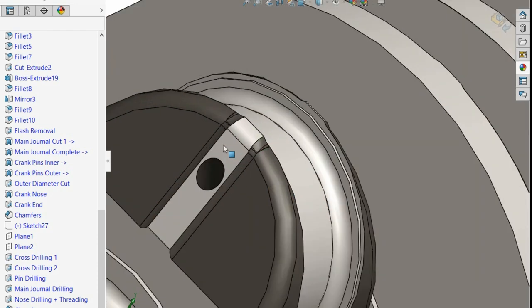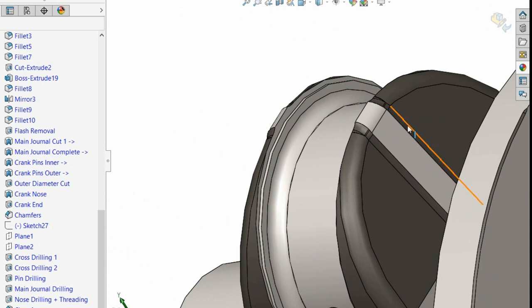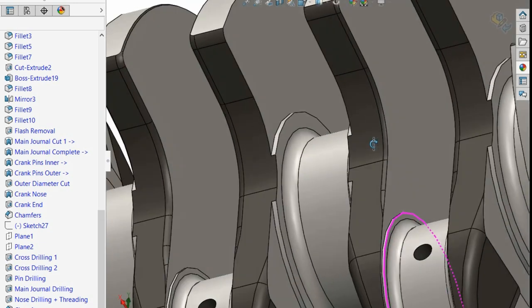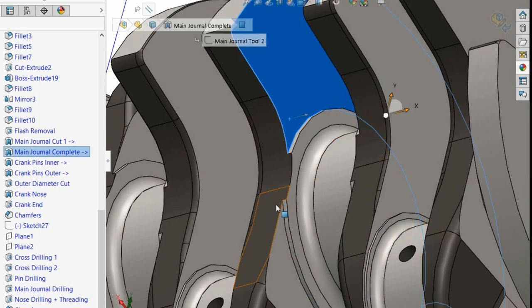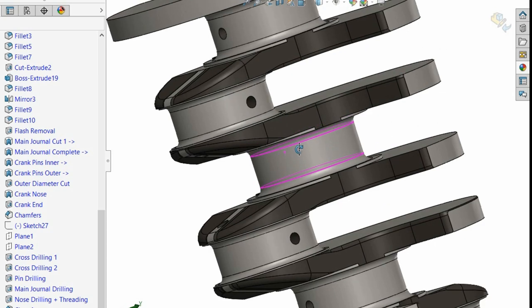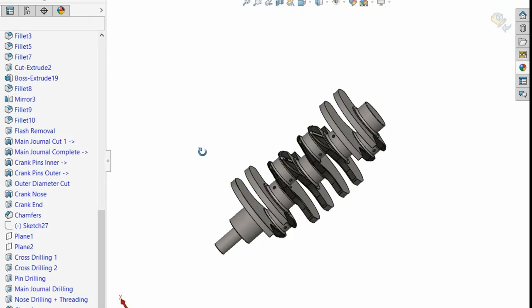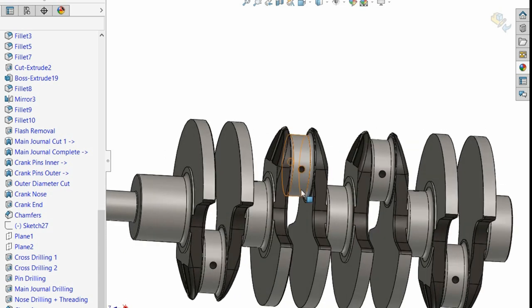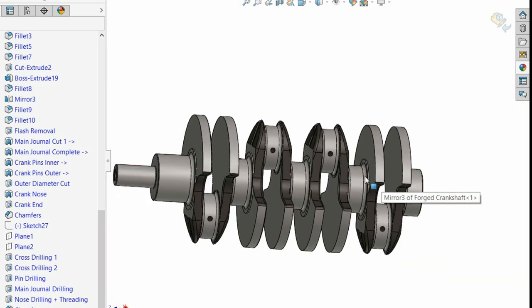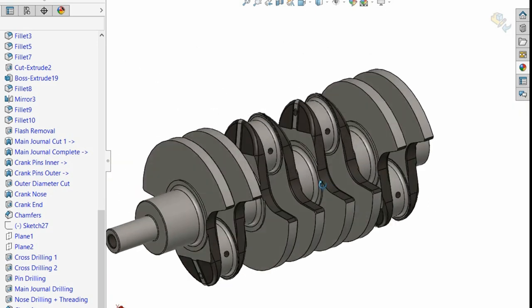And you can see where the forged line was here. You can see this ridge here. And that's basically where the metal's allowed to squish out to deform into. Where they put these cuts, it isn't exactly a full circle. It's not perfect, right? It is mass manufactured. And when I say stuff about Koenigseggs, or Freevalve, God, the precision you need, and you want to pump out millions of them. It's taken us this long to get this good at doing 16 valves. You know what I mean? It's very difficult to get the tolerances you need, and so on and so forth.